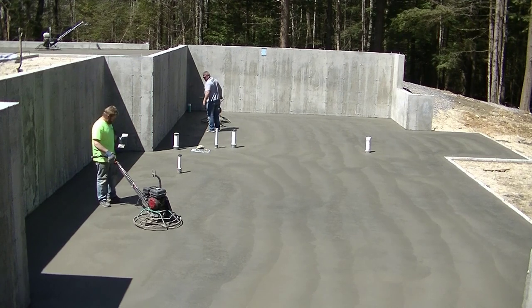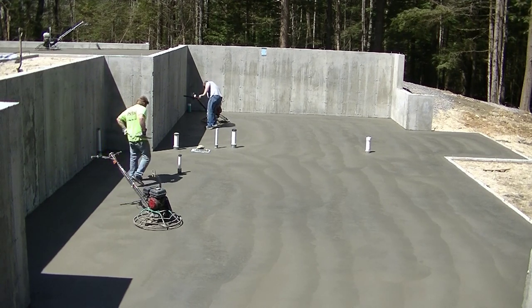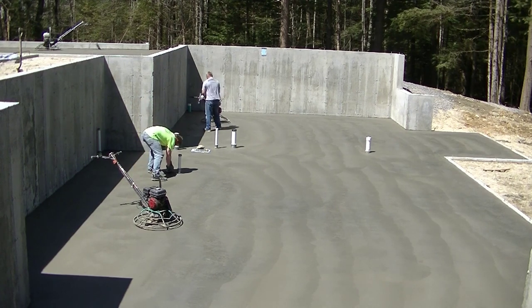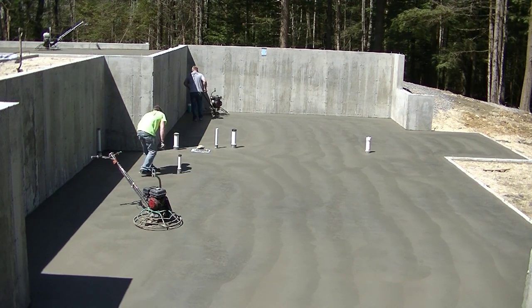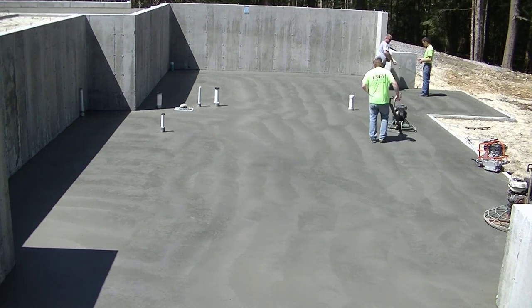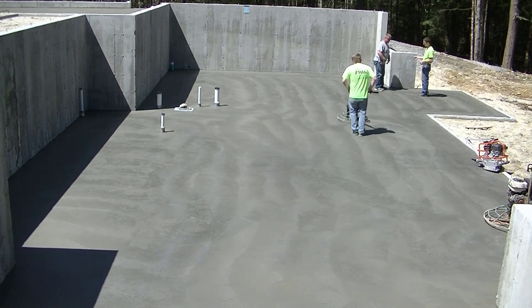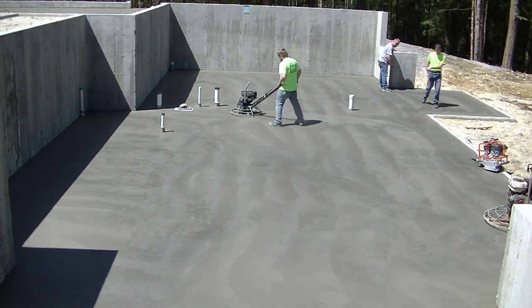You can see I've got the power trowel up on the garage floor now and I'm starting to finish that one. These guys are pretty good about doing their edges — they try to hit them almost every time they go around with the power trowel so the edges look just as smooth as the area the trowel hit. Having nasty-looking edges but a really nice-looking floor takes away from the whole thing.